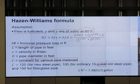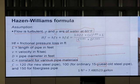Question on this Hazen-Williams equation. Have you seen it before? Jason, you have seen it before. What is the C value? What is that for? To account for what? Different material, of course. Is that about roughness? Yeah, it's about the roughness of the pipe. It's not the chemical property of the material or anything. Turbulent flow has to do something with the roughness. Can we use the Hazen-Williams equation for laminar flow? Carla, for laminar flow, will the Hazen-Williams equation work, true or false? False. Very good. It doesn't work because it's for turbulent flow.